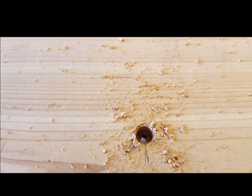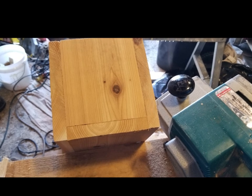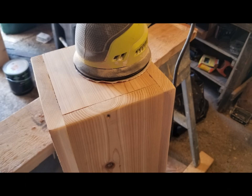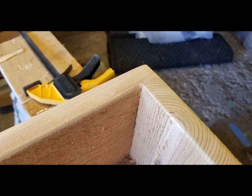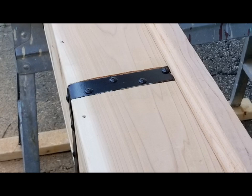Drilling in is fine, but drilling through and punching through does split the wood a lot of times. So I use the belt sander to even everything up and then a smaller orbital sander to smooth it out. There's one of the butt joints — you can barely see it. And now to put on these pieces of crown molding.